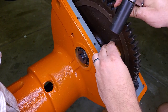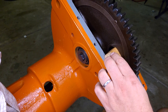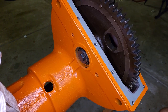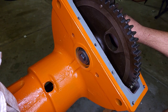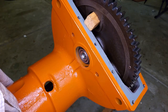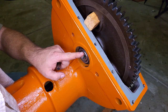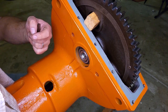We got it tight. We have no end play at this point, there's no slack, but there's an issue here. I know the book said there were supposed to be spacers behind here that set the preload. Basically, you'd have a washer in between the shaft and the big washer that would prevent the shaft from pulling all the way up. It looks flush at this point. Using a parting tool as a straight edge, I'll check the gap with a feeler gauge.